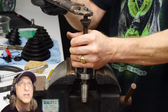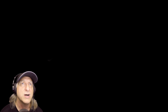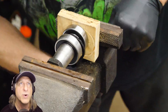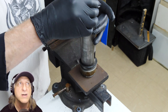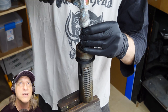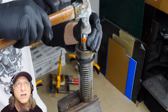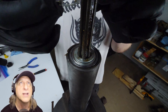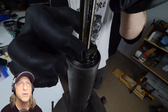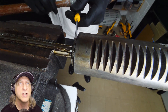Just use whatever you've got around. Now they're putting it back together. That's a good idea — use a piece of wood and a socket to press them on so you press on the right side of the bearing race so you don't mess up the bearings. He's wearing a Motorhead shirt now — this guy's all right. Use a socket, tap those bearings in, nice. A little oil just because it's a press fit — makes them slide on just a little bit better.